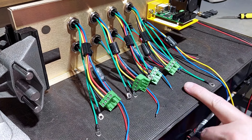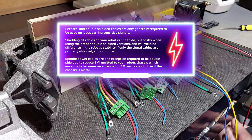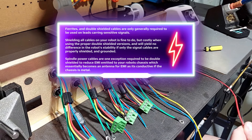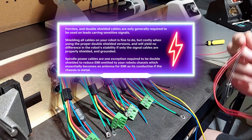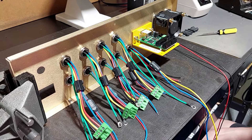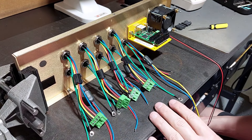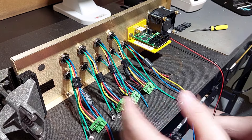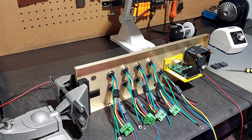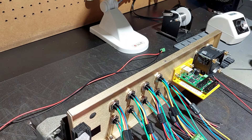You do not need to shield everything in the system. For instance, the fan does not need shielding — it's just running the fan. A general power lead going from your power supply to your drives typically does not need shielding. If you're shielding the cables carrying the sensitive step and direction signals on servo or stepper systems, those are already filtered, so there's no point shielding everything else.